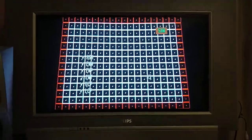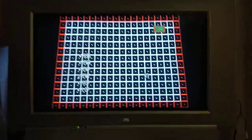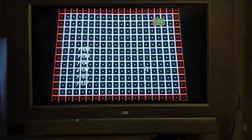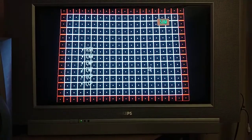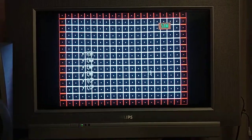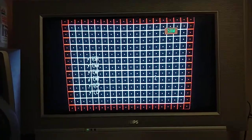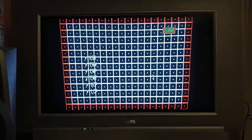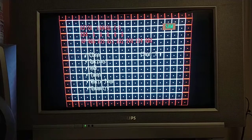The highest value you can pick is 63. So I assume 0 to 64 are the 64 degrees of positive or minus, whatever. Anyway, it decided that when I set it down to 0, it was going to save that value as 60. Now, mind you, I have been in 4x3 mode this entire time. Let's set the trapezoid to 3, maybe. Go to the top level. Press power to shut it off. Power to come back on.